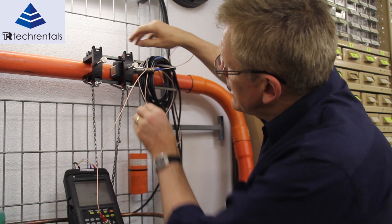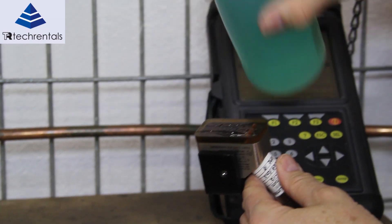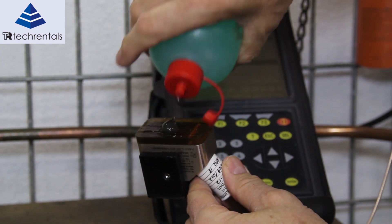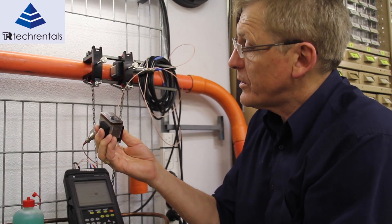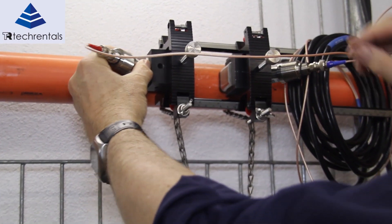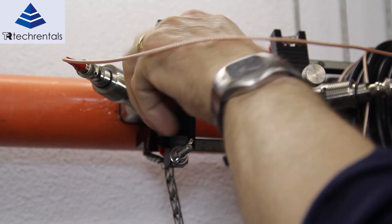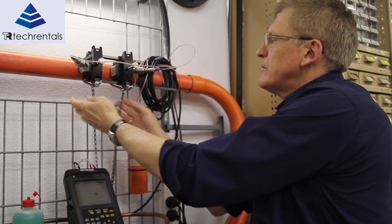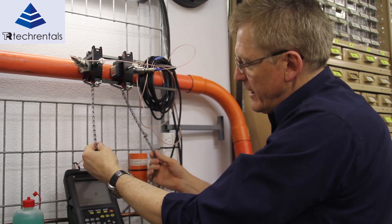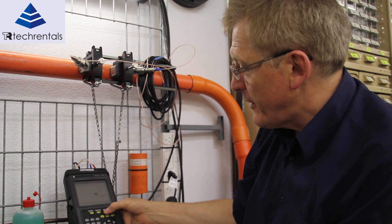Because we've selected four, that means the required distance between the two transducers is 102 millimeters. This is set on this jig — it's from this outer edge here to the inner edge there, set at 102 millimeters. We need to set the transducers on the pipe fairly accurately, and we also need to put coupling gel on to get the signal through. We mount the two transducers aligned center to center. Good firm connection — we've mounted the fixture with the chains around.